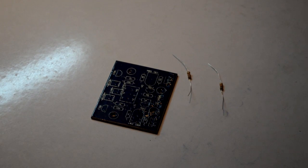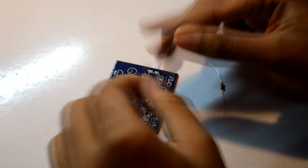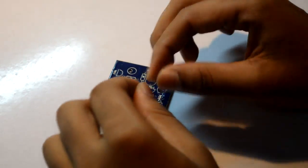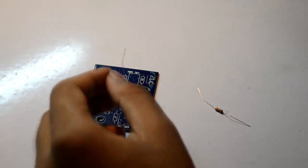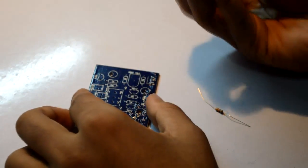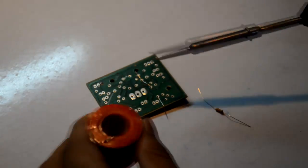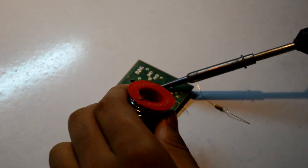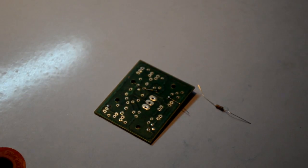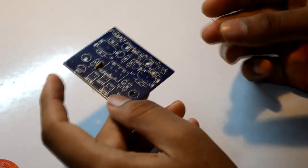Now let's go ahead and start with the soldering of the circuit. I have chosen some resistors — with the help of the BB Roy mnemonic I determined that these resistors are 10k ohms. Here is a 10k ohm slot and here is for the second one. Before you actually go ahead and solder, take a pen knife and scrape off the legs — there is a tiny coating which doesn't allow the components to get soldered on the PCB. So fix it right in the 10k ohm slot, bend the legs, bring in your soldering iron, and give it a very tiny spot of solder. Cut off the excess legs. Repeat the same procedure for the remaining resistors.